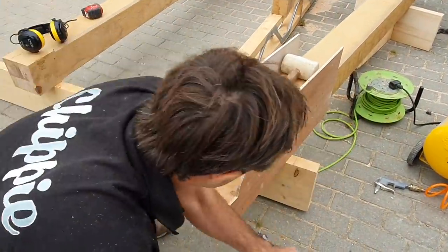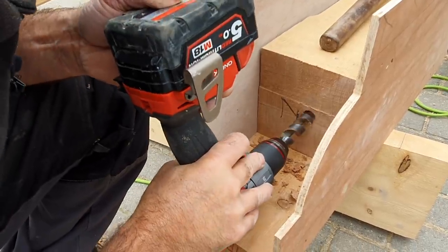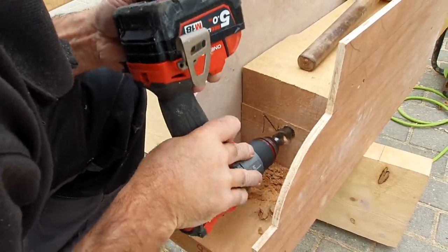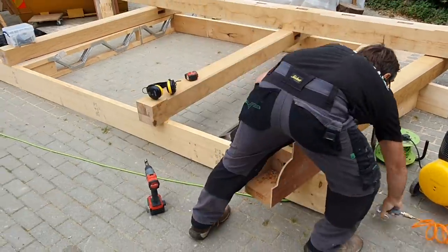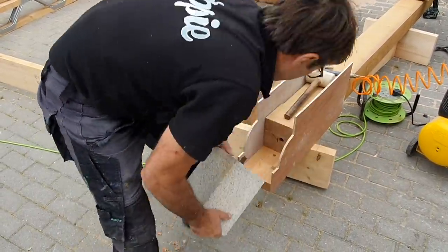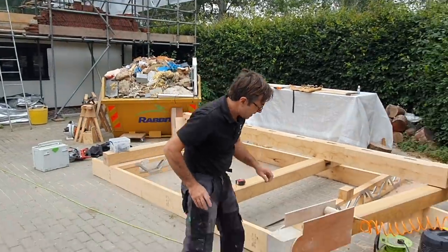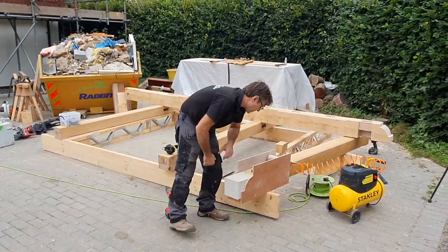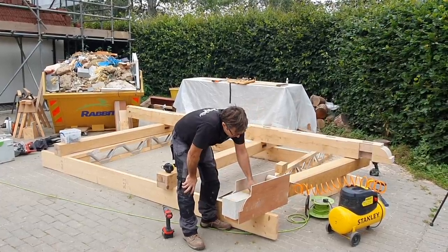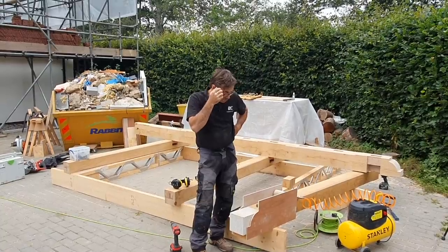I'll bore this out, going slightly oversized with a little wiggle, blow that out and slide it back in and check if I need to make any adjustment. You can see that's the easiest and quickest way of getting those stones to fit. Now, because the timber and the stones are never exactly the same, I'm going to put a very small bevel all the way around the bottom of those posts so the marriage between the post and the stone is a little bit softer.